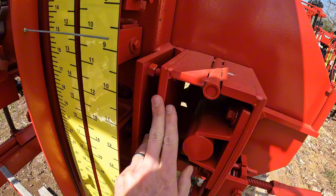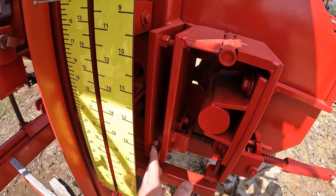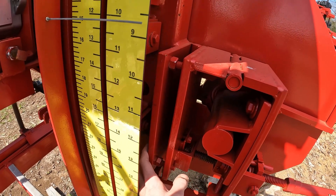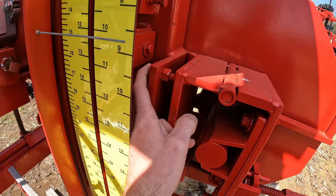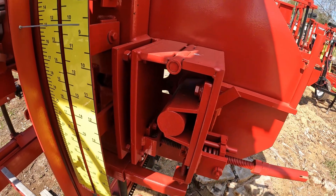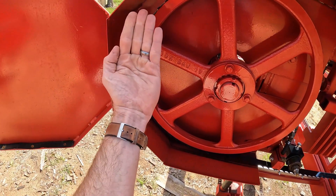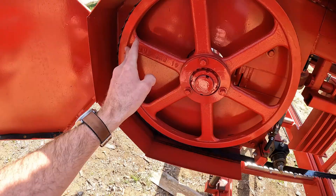On our tension system, I've got this half inch plate here and I do have a vertical hinge with a bolt top and bottom. I can loosen these jam nuts between the plates and then get a wrench in — I use the box end of my wrench, three quarter to get on that bolt. When I tighten these two bolts I want to try to keep that as even as I can, so if I go a quarter turn at the top then go a quarter turn at the bottom. If I tighten this bolt clockwise, that will bring the blade back on the wheel. If I loosen this bolt counterclockwise, it pushes the blade out on the wheel, pushes it forward. So that blade is going to follow the outer edge of that band wheel — if I tilt it this way, the blade is going to ride farther out; if I tilt it the other way, the blade is going to run farther back.